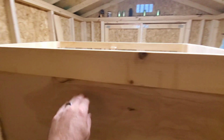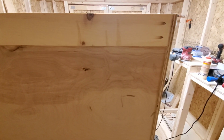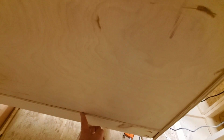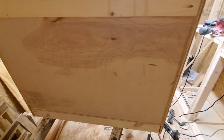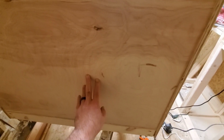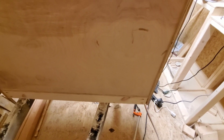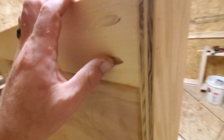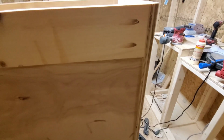And for the longest time, that was the only thing on the back side connecting the two end panels, was the top back rail. So I was gonna just get everything cut and slide it in from the bottom and then put the bottom shelf in. But here's what I did. Being in a rush, being sleep deprived, put the bottom shelf in, put the bottom back rail in, screwed, glued, shot brads. And I was like, oh God, I can't slide it in now. I don't want to take this back off. You know, I've got a couple brads right there, a little putty, and I've got these in glue, and I got 2 Kreg jig pocket holes in there.